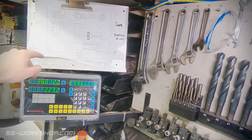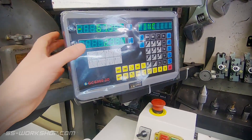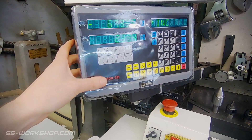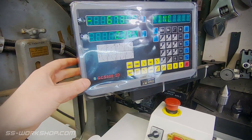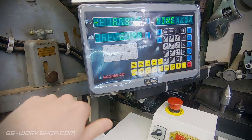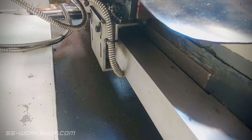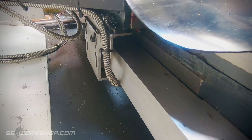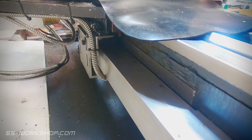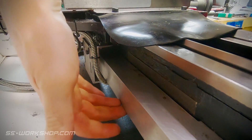I've added a clipboard just above my digital readout, which really helps when you're trying to follow a set of drawings. Next up, digital readout. For an amateur machinist, backlash can be a real challenge — so can counting the revolutions of a handwheel — so this one's definitely a game changer. This one uses glass scales, has a bunch of great features, and is a clone of a professional unit. It's definitely not necessary to jump into a unit like this, as there are some really cost effective magnetic scales that will give you a simple readout.